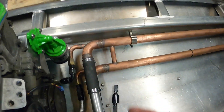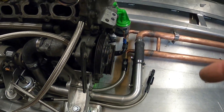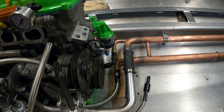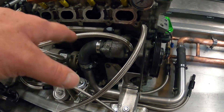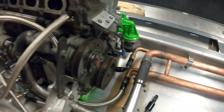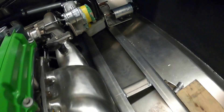We've just welded a threaded nipple on each end so you can screw your fittings in. The stainless tube is just to bring all the pipework from the engine together so it joins up nicely — you could weld bigger threads on or just put a hose tail. After the river water comes in through the inlet and goes through the heat exchanger, it comes out this tube up here and goes into a ball valve so you can slow the flow through the exchanger, because if it goes too fast it's not efficient at taking away the heat.